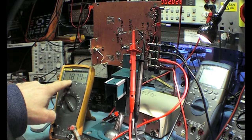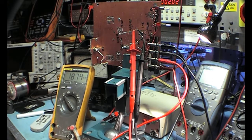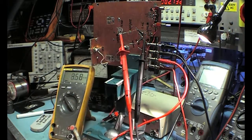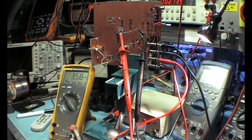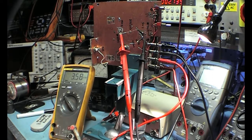Because if I would adjust that until this meter gives 2 volts, then the total voltage will be much more than 10 volts. This is a rather big fault just over 1 M. But what if we measure it over 2 M? Then you see instead of 4 volts we have already 420 millivolts. So it doesn't matter what kind of meter you take, in price or in accuracy.